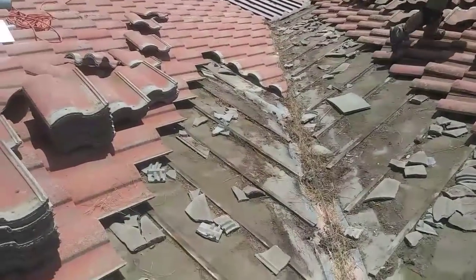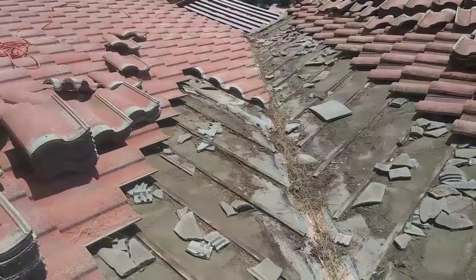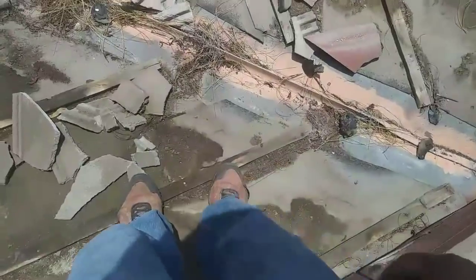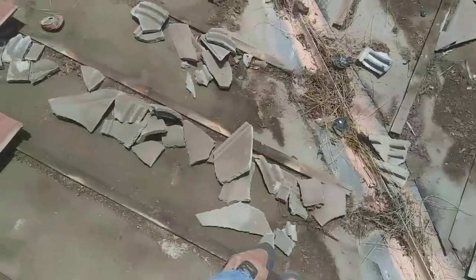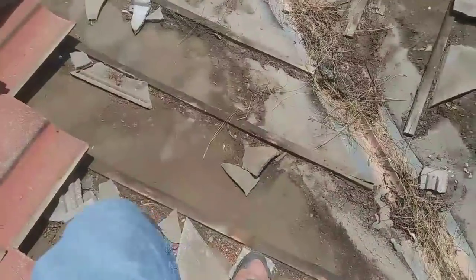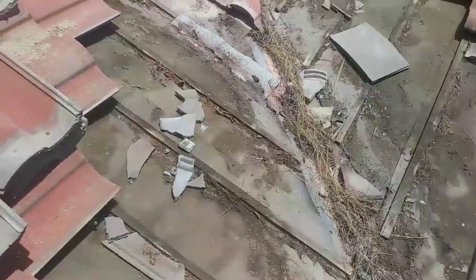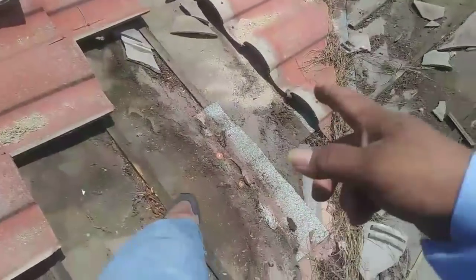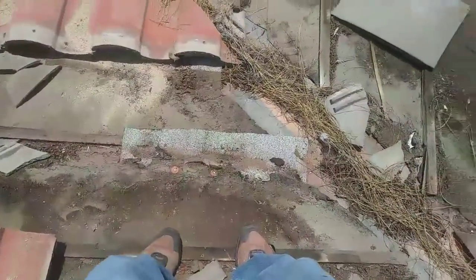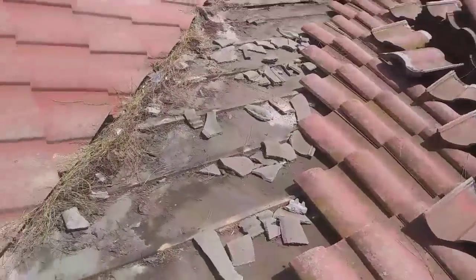They left a mess right here. A lot of guys don't have a clue how to do tile and they go ahead and install a tile roof. Please do not mount the wood battens on top of the valley or close to the valley because you're gonna have problems. Right here they had a severe water leak underneath and they put plastic all over here and they couldn't stop it because it was coming from the valley. They tried to fix it and couldn't fix it — so-called wannabe roofers.